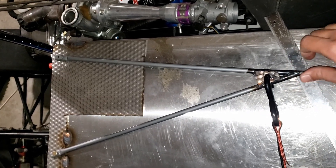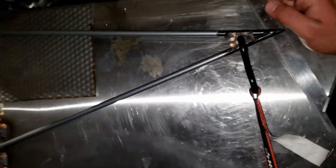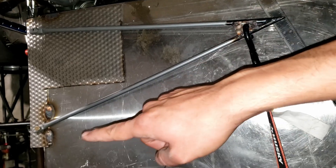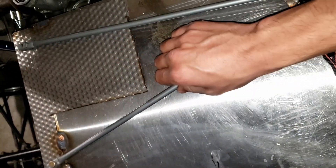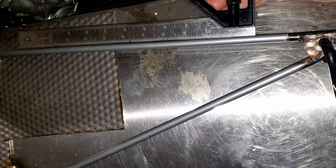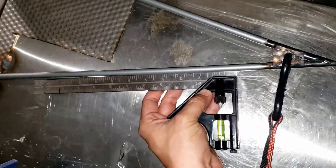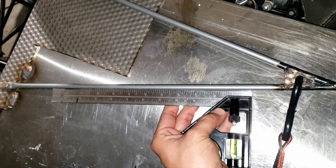What I have here is a simple A-arm with bolted connections down at the end. Those are going to act as a hinge — I'll call this the X-axis — it's allowed to freely pivot around the X-axis. I have a ratchet strap from that end to the table, and the plate that the A-arm is bolted to is welded to the table. This is going to simulate force under braking. This arm is pretty straight, so it has a slight bend in it already, but for this test that should be fine — just to see a starting point.